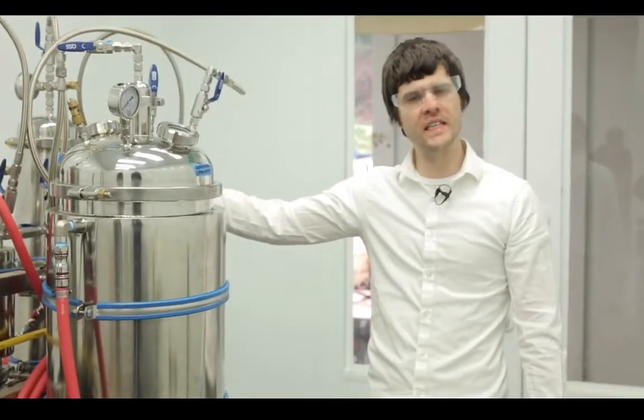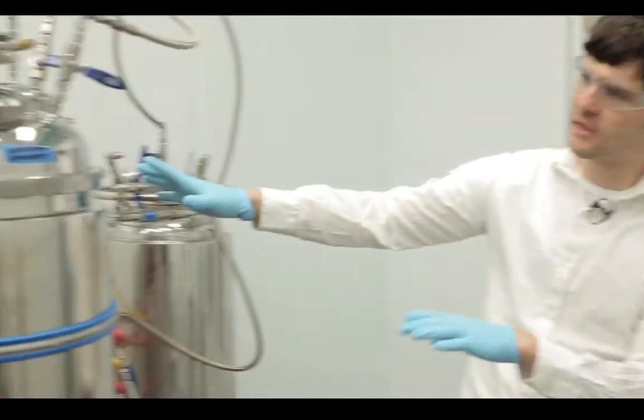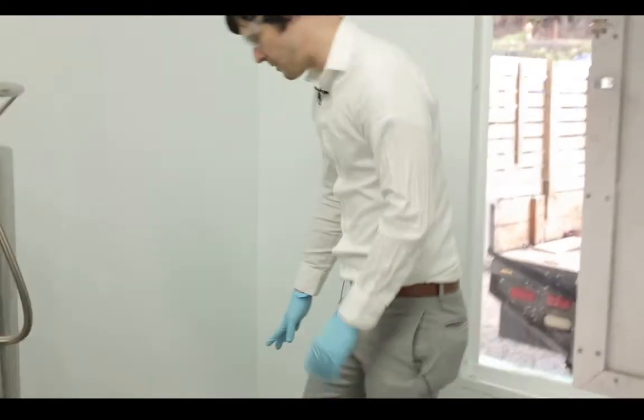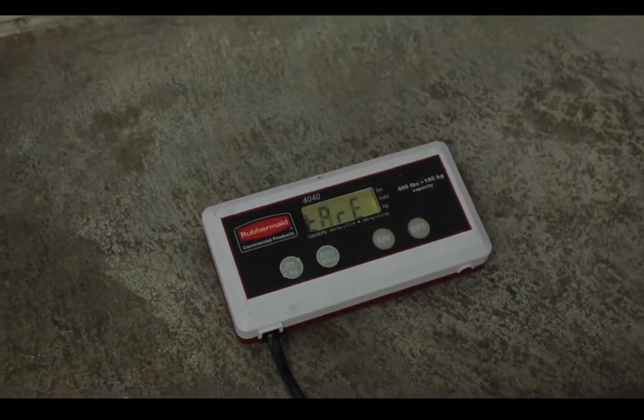Once we have successfully loaded our cannabis, we are ready once again for the vacuum procedure. So now that we have high-grade biomass loaded inside of our extraction container, and we have also distilled gas to a clean level, and then put the entire system under vacuum, we are going to start our extraction process. Step number one is we want to make sure that our scale is zeroed out and tared to 0 pounds, and that will allow us to monitor how much gas we're putting in.